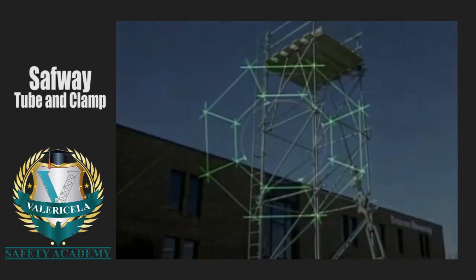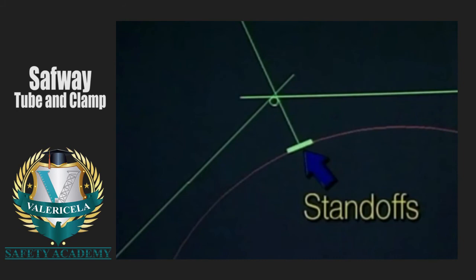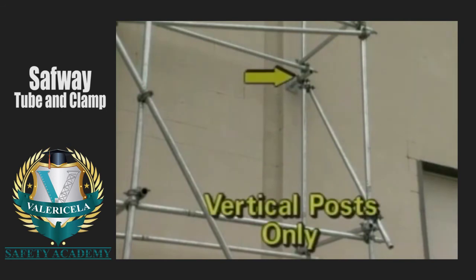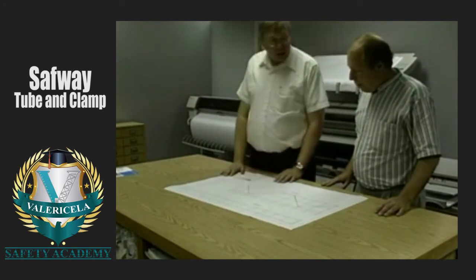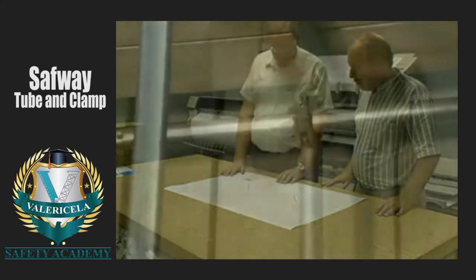If the scaffold completely surrounds a circular structure, standoffs may be used instead of ties. Keep in mind that ties and standoffs should be an extension of bearers or tubes clamped to vertical posts close to a horizontal member with right-angle clamps. Always consult your project engineer before bracing, tying, or guying, and make sure that the run is properly tied, guyed, or braced according to the plan.